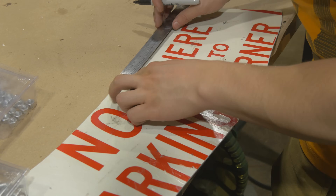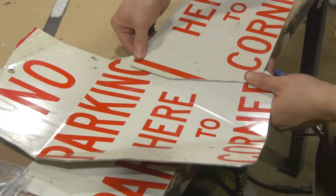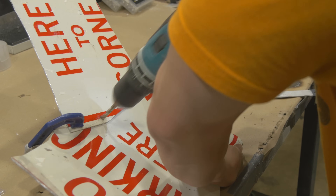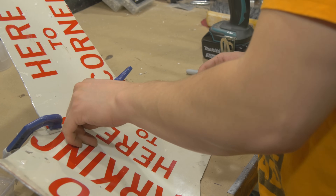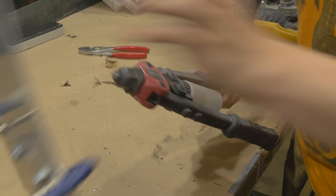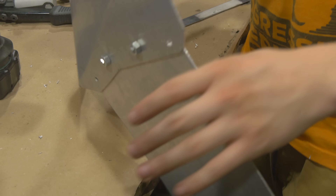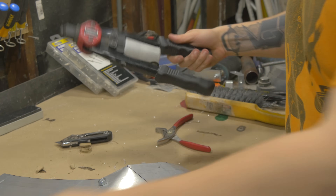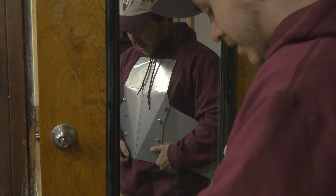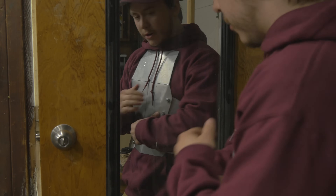All right. Now, on the side that has all the street sign stuff — on the edge that's going to connect to the main plate — I'm going to mark in about an inch from the edge. With that marked, I'll line both of those dots up with the edge, clamp it up, and mark where I drill my holes. Now I'm going to pop these rivets through, and for no reason other than to make it look better, I'm going to be putting a nut on the end of each of the rivets. Now we can take off the clamps and drill the next holes. I've got both of these side plates on it, but obviously they're still straight, so let's change that. I obviously still have some to go right there — probably have to do the rest of it by hand.